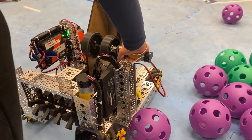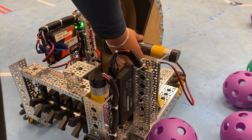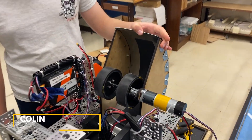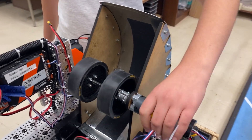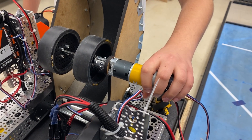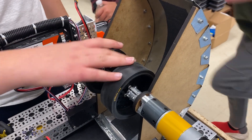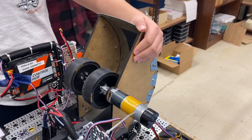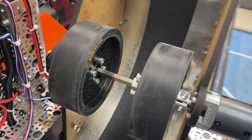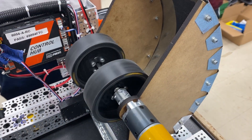I'm a little worried that for 230 seconds it might get kind of hot, but that was at 100%. I'm Colin and today I'll be talking about how we designed our launcher. So here we have a 312 RPM motor that's been converted into a 6,000 RPM motor with a GoBILDA one-to-one conversion kit. We have two rhino wheels on a large shaft, and a hooded shooter constructed out of laser-cut MDF and a metal backboard with grip tape to allow for extra traction. A ball comes in here and as it hits the flywheels it's flung out the top into the goal.